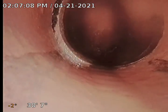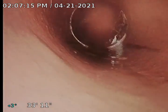This is still 6-inch diameter clay sewer line, with the joint, again, about every 2 feet. This has been recently jetted, so the roots are small, but I was told they were pretty significant. This is where the sewer line is going from 4-inch to 6-inch diameter transition. We are also going to pause the video briefly to go locate this spot. So, pausing here.